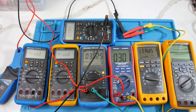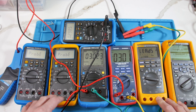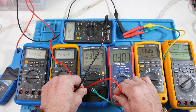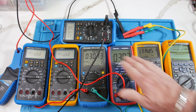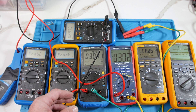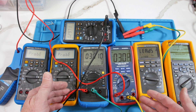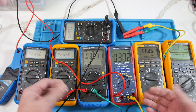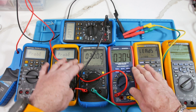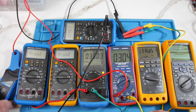You may do this because let's say you're reading 15 amps — most meters are only capable of 10 amps these days. So you can take two wires and read half the current in one, and half in the other. You can see they're both about three amps. So that helps you take readings when you're trying to read current above what your instrumentation is capable of — you can just split the current up.